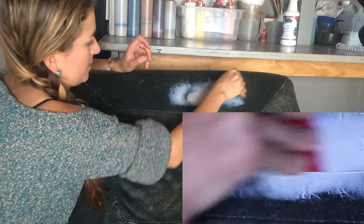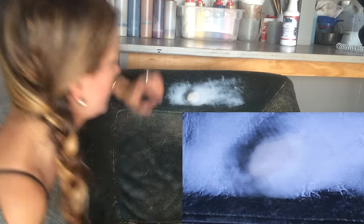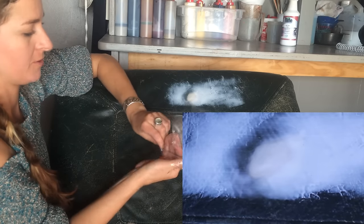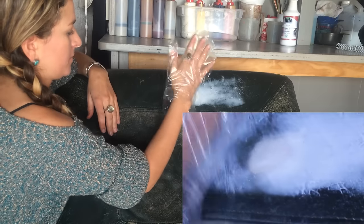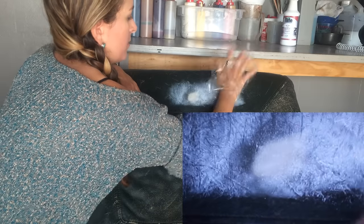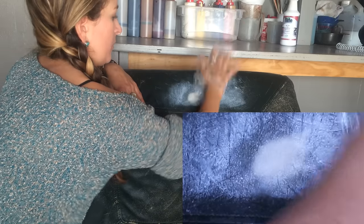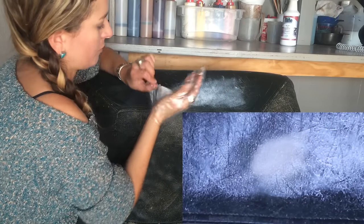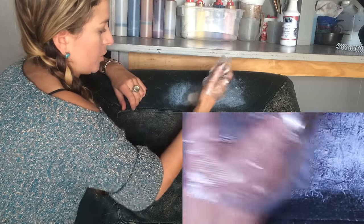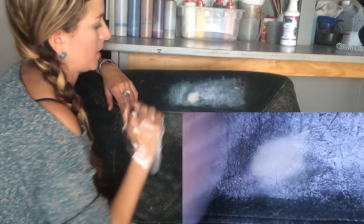That's a really nice spread, but you get these little lines in there from the card, and it'll be too smooth if you don't texturize it. I love to work with just a food handler's glove and sort of emboss the compound. Where you've got it on thicker, you'll see that it's a little more pronounced. Just kind of rework that — you can always sand it down later — and allow it to cure.